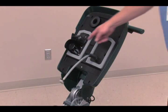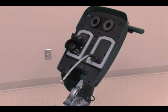When scrubbing, view the water pickup from the recovery window. When the water pickup stops or the vacuum motor sound changes, stop scrubbing and empty the recovery tank. Note: the vacuum shutoff float should be inspected and cleaned often.